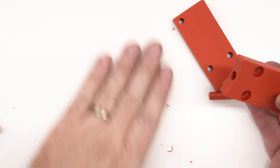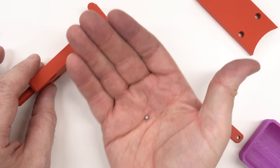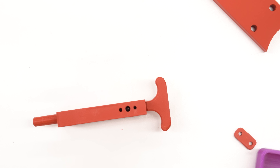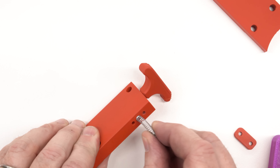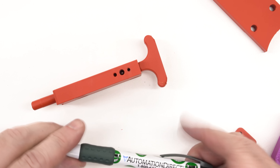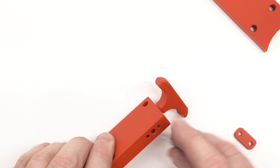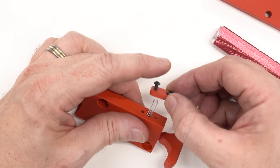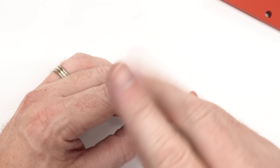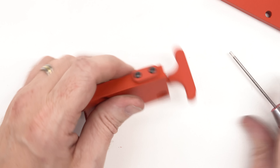The real reason I wanted to prototype was to test the ball detent mechanism. I'll assemble that and put the pin in first with a 4 millimeter ball bearing — I got this by disassembling a normal 608 size skate bearing; turns out the balls in those are 4 millimeters. I took apart a whole bunch of pens trying to find the right spring, and all of them except one had springs that were too large. The exception is a pen I got from AutomationDirect as swag — the spring in that is perfect. It fits nicely in the hole, then I'll put the cap on with two M3 button head screws.